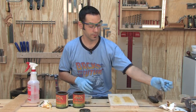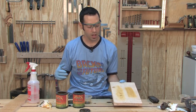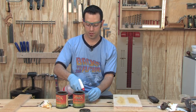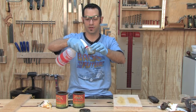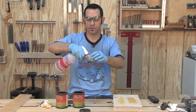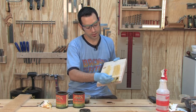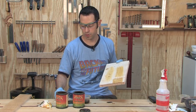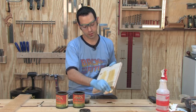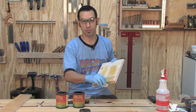I need to dilute this pretty significantly. Previous tests diluted to five parts and ten parts water were still too intense — just too much color. I'm using a little spray bottle to keep diluting until it's far enough, then testing it on the surface. These dyes typically go on pretty dark, but as they dry you get a little less intense color. Sometimes it just looks like crap until you get your finish applied on top.